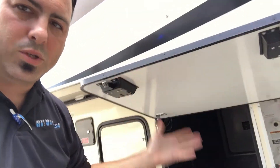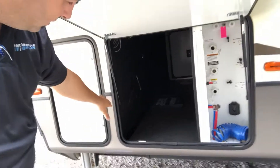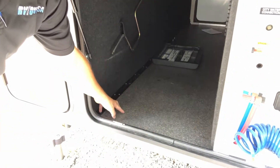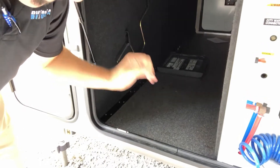When you open up the compartment doors — the baggage compartment in here — if this seal has been broken and the wood is now exposed, press down on the inside. If it gives and it's soft, that's another indicator that it's had water in it. Water is bad for a couple of reasons: it's an indication that somebody left it in the sun, left slides out, and didn't take care of the unit — so you lose a lot of your investment.